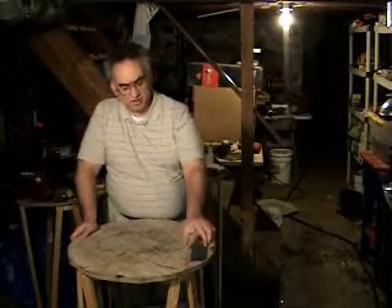Doing my fine grinding, I progressed pretty well. But I noticed the bevel on the edge of my blank was starting to wear out. A bevel is pretty important — it gives you a break in the surface between the optical surface and the edge of the glass. With a bevel, you don't really run the risk of chipping the glass. However, if you have the surface all the way out to the very edge and you're grinding and polishing, you could get a clamshell — you could get a piece to chip off. So what I'm going to do now is re-bevel the glass before I go into 5 micron.